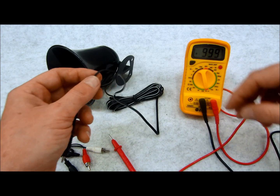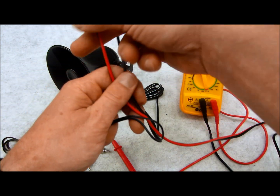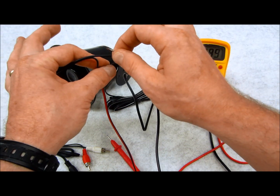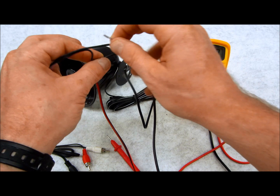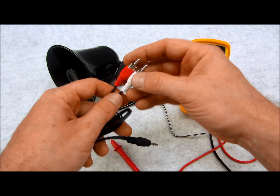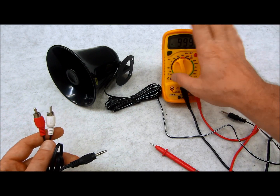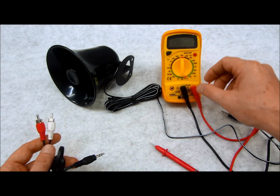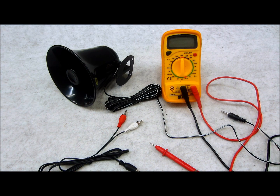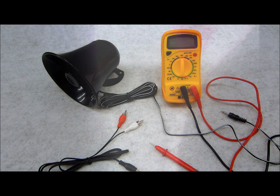In this case, the positive wire is the stripe wire and the negative is the solid non-stripe wire. With that said, you can cut these off, take your speaker wire — your red goes to your stripe wire, your solid black goes to your black — and you have a perfect connection. From there you can put it into an adapter, add pigtail RCAs, the sky's the limit. Always use a multimeter — they come with manuals, are very easy to use, and this works great for PA speakers, home speakers, car speakers, and marine/boat applications.